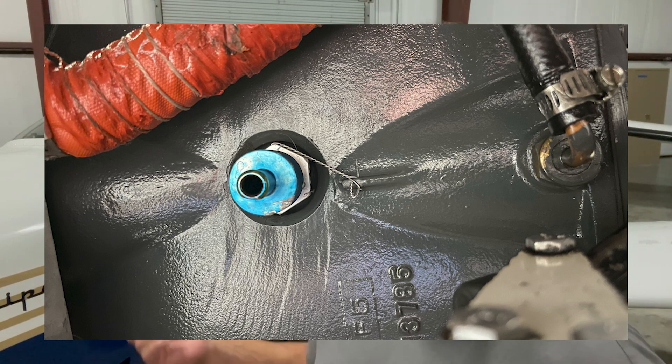I got my head back under there, and where I thought the oil leak was coming from initially seemed like the right guess. The bottom of the engine has an oil drain plug, just like in a car — usually just a bolt. What a lot of people do on their airplanes is install what's called a quick drain plug. In an airplane, where that oil drain plug is may be above a lot of other things in the engine, so they came out with quick drain plugs that have a little bib on the bottom you can put a small hose onto, run it down to a bucket, for a nice clean oil change.